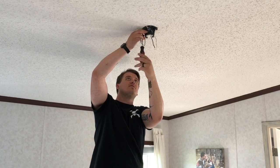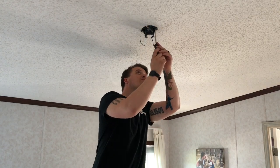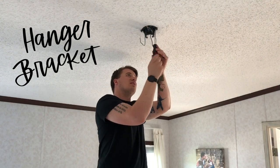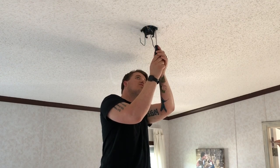The first thing you're going to need to do is take down your old light fixture and take down the hanger bracket. Ceiling fans are heavier, so they come with a different hanger bracket than typical light fixtures — the first thing you'll want to do is put that new hanger bracket in. Reminder to flip the breaker before you touch anything electrical.